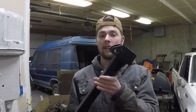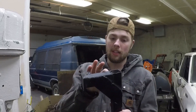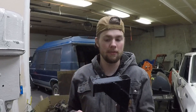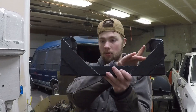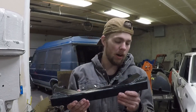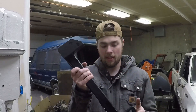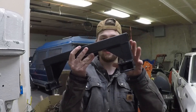We got some porosity and wormhole in these welds, but the surface metal blended with a good puddle, so it's not really the end of the world. We'll be able to keep moving on that. With these dog ears, I did cut them out on the drill press — that worked out great. The only downside was when I went to weld it, I got a little overzealous on this side here.